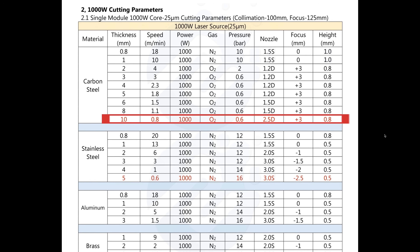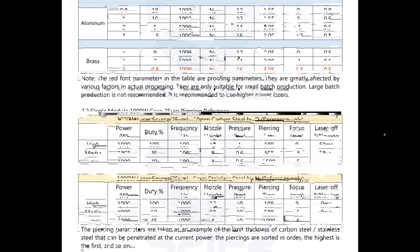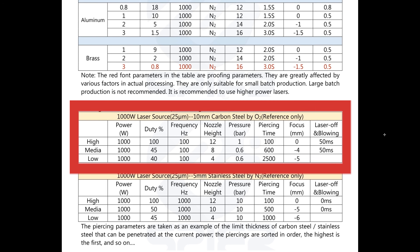Here's the catch — this 1000 watt laser source isn't capable of cutting 10 millimeter carbon steel right off the get go. First, it needs to do a piercing operation to punch a hole through the material before it can begin the cut. If I scroll down here a little further, you'll see there's a reference for piercing 10 millimeter carbon steel. This is a three-stage piercing operation where at each of the different stages there's going to be a different nozzle height, a different focus position, and a different time.